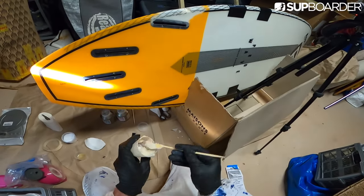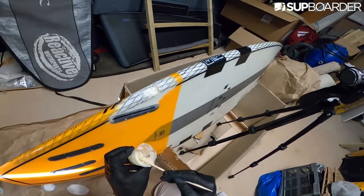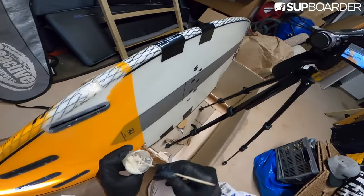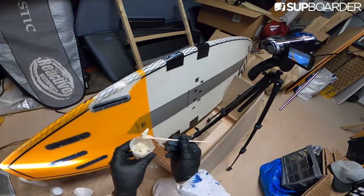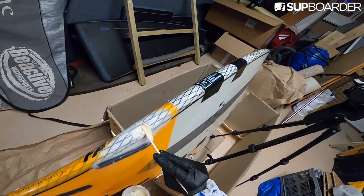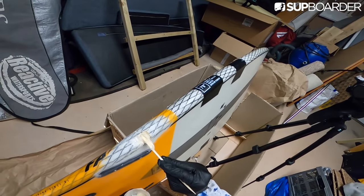Now, to some extent, we have to work relatively quick, because epoxy will cure with an exothermic reaction. That means that if it's in bulk, it will start cooking. It heats up as the reaction starts. So this pot is going to start heating up, and if we don't get it in there relatively quickly, it'll cure in the pot, and then it's not going to be much fun.